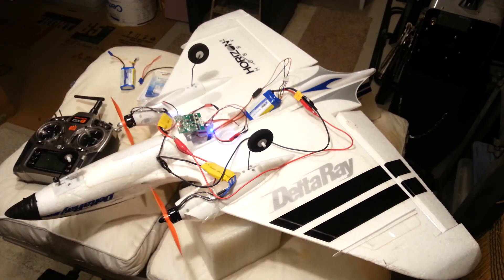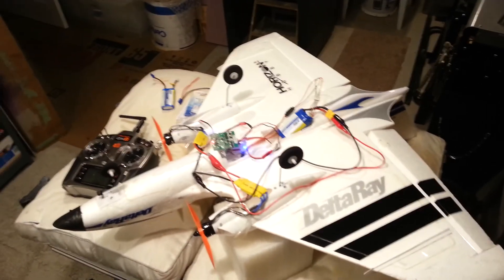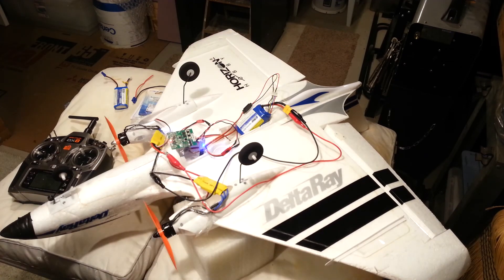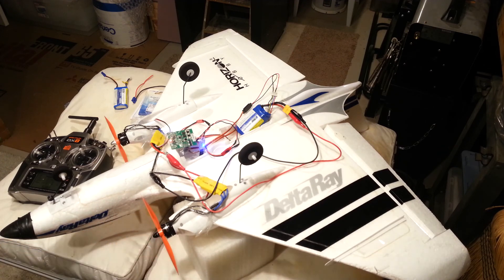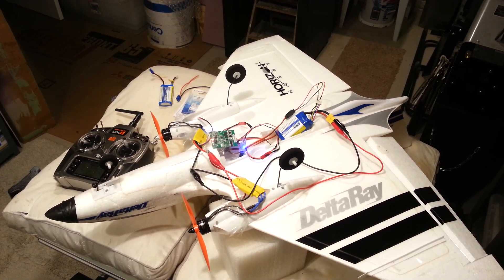The cool thing is he gets to keep SAFE, which is great if you're learning to fly. The Delta Ray is a great plane, but you need really good conditions — it just rolls out forever. Anyway, have fun with that. If you want some excitement, check out my other videos where I did my Delta Ray conversions — I put a rudder in, got two brushless motors, all sorts of cool things with LEDs, running them on 4S. This one will probably run on 3S, but nobody's saying you can't run it on 4S if the Emax motors handle it. Thanks a lot for watching — hope this helps somebody out. Don't forget to like and subscribe.